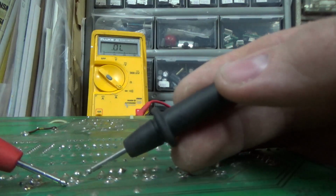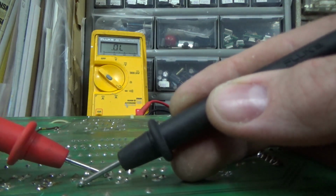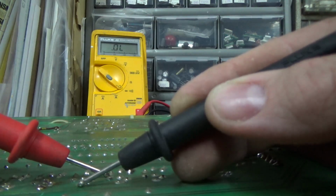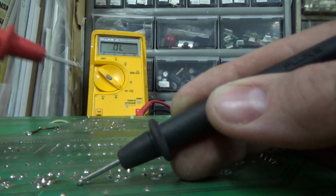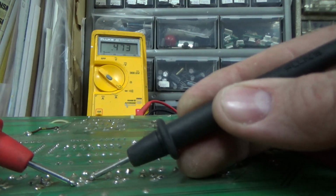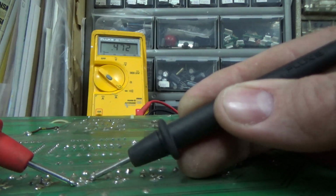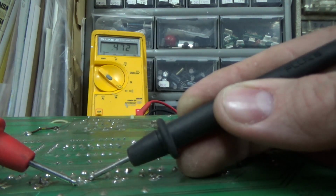There's 3 areas basically. So there's not connected, which is like that. It says open line, or it's really high. So not connected, all the way down to about 0.79 or something like that. Basically means there's no connection there. Okay, and then there's this connection, which is between 0.4 and 0.7 or so. That means there's a gate there. There's a voltage drop there, right?